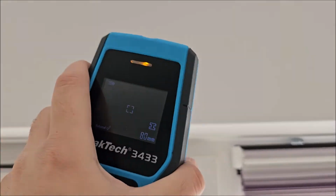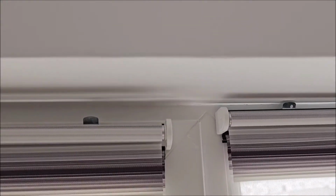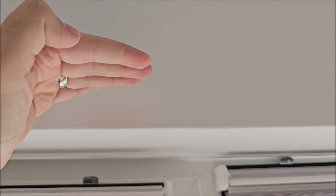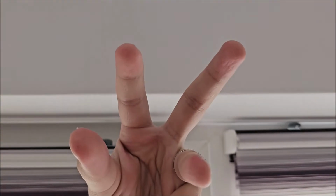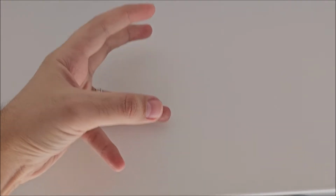So, if I would need to drill a hole through this, I would choose the areas where this says it's fairly safe. Obviously, it cannot detect through the depth of this thing. It's really thick. But as far as I know from how you put rebars, you make some kind of 4 corners to them. So they should be like this. So I have ones at this level and ones somewhere around here. So in here I should be okay. In theory. Depends on how the builders did it. But at least it gives me a fighting chance, let's say, to not hit rebar.